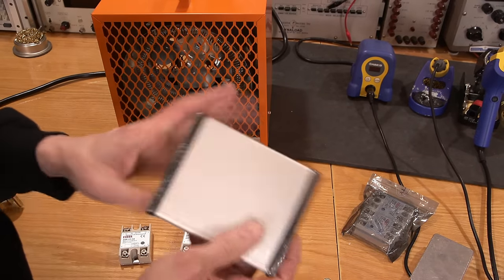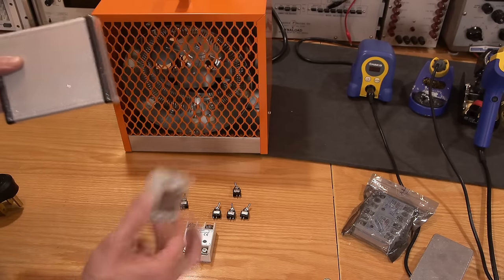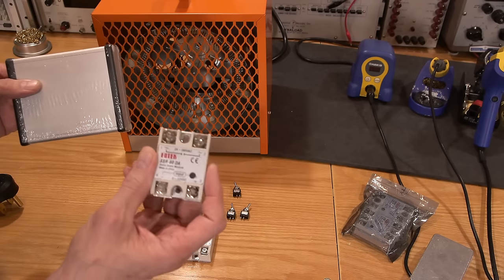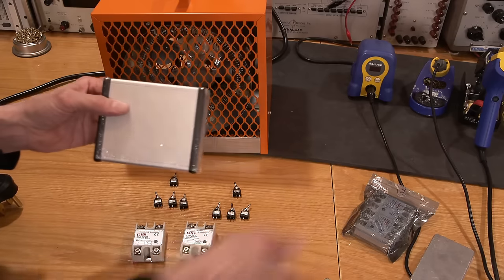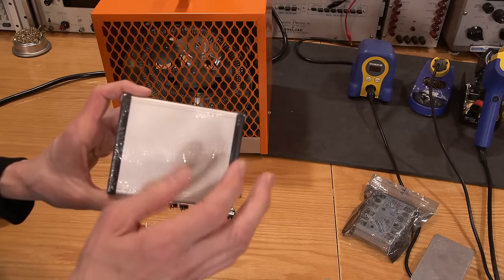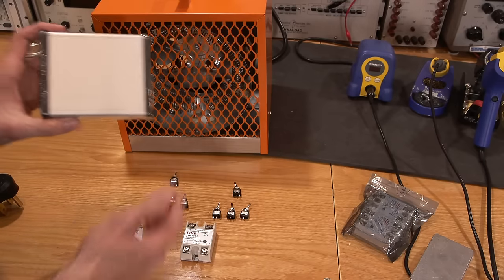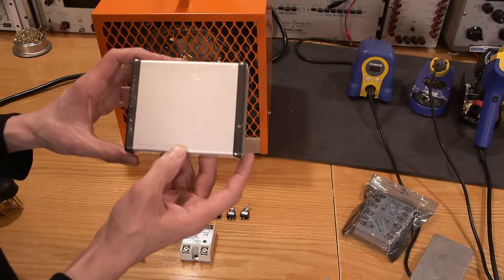I'll probably put it into this project box here, just these little switches here. These will be mounted externally close to some plugs down on the main board here, and I'll have an umbilical cord run from this so I can turn everything on individually on this box. I can fit a battery in here. The battery will power up the emitter side of these optos. I figure that should do the trick.